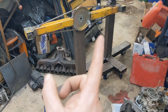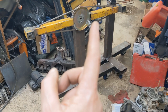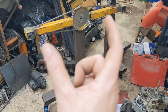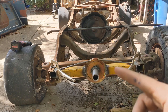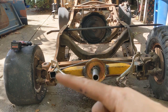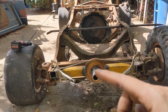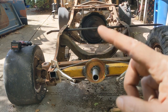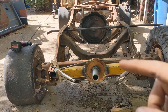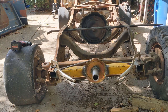It could use a little bit of cleanup and some paint, but otherwise this side is done. I still need to do one for the front, but it's just a replication of this same scenario, just a little bit shorter, so I'm not going to bother showing you that. This will give you a better perspective of what it looks like — this is the front one, it's all fabricated. I still have to drill the holes and bolt it to the frame. The reality is I can't put it onto the rotisserie until I get this transmission and transfer case out, and I also have to cut it off of the axle — so I need to cut all the U-bolts. That's going to take a little bit of time. Just need to drill holes, get some bolts in, and get these things attached.